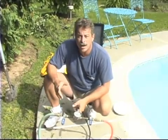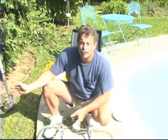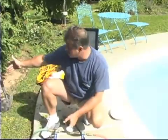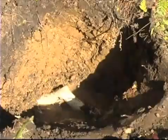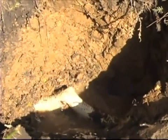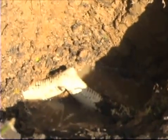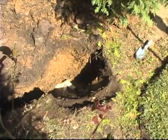In this particular situation, we lucked out and actually heard the water bubbling back through the ground. So it's behind the apron and we've already excavated the ditch — we actually found where the pipe is leaking. It had a piece of aggregate under the pipe; tree roots pushed the aggregate up, collapsed the pipe, and caused both a leak and a blockage. We can show you now — we have the test equipment hooked up, the ditch dug out, and the pipe exposed, getting ready to cut the pipe and conduct a repair.